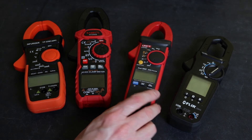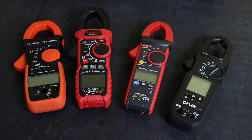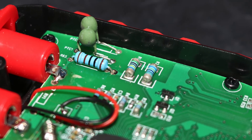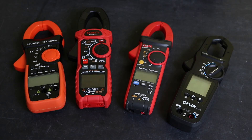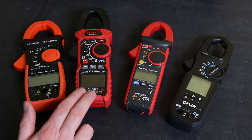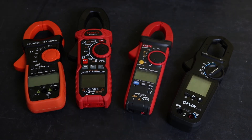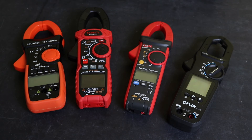So the ranking is: FLIR first, followed by the Uni-T 216C which is fairly respectable. The Kaiweats is a bit of a shame — I like its display and it has a reasonably robust build, but the input protection is lacking and it suffered accuracy issues on high currents. If those two issues were resolved, the Kaiweats would be a strong challenger to the Uni-T 216C. It has good functionality overall but needs more work on implementation.